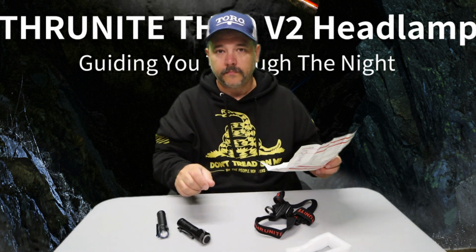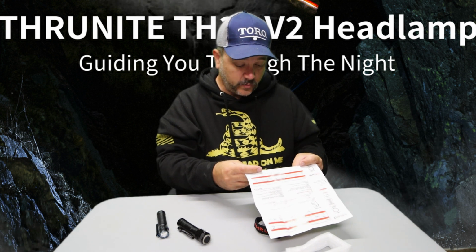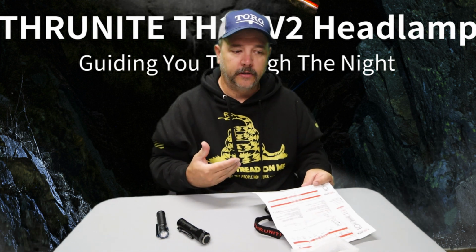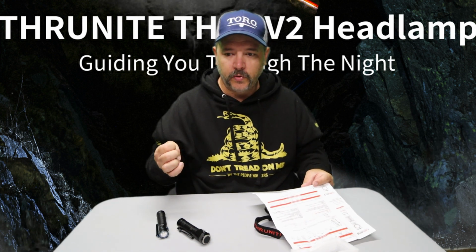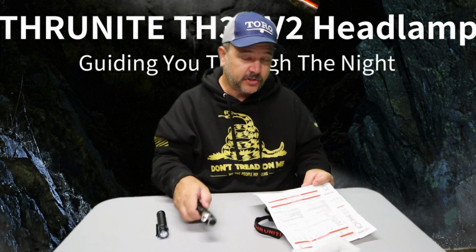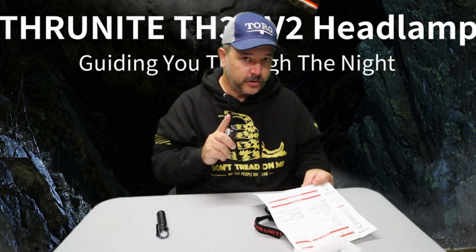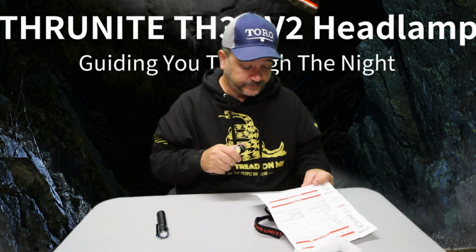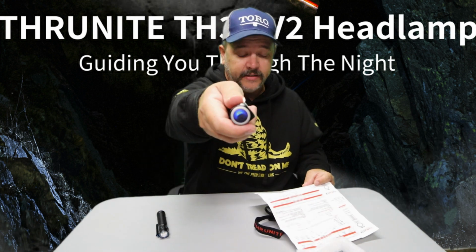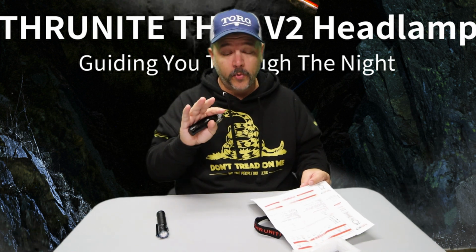Stand by. Okay, interesting. Indicator, power capacity. Flashing red, you're going to be running 2.6 to 2.9 volts. Like I told you earlier, these batteries can run down to a working condition of 3.1, 3.2 volts. So the tail cap right here will start flashing red, and that's where you should turn your flashlight off and charge it. 11 to 20%, it's just going to be a solid red. And as you can see right now, it's blue, which indicates that this is running 3.2 to 4.2 volts.